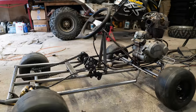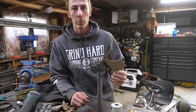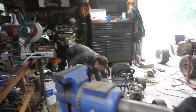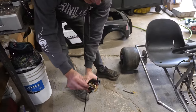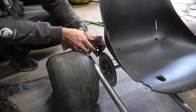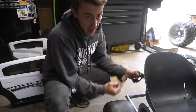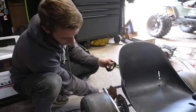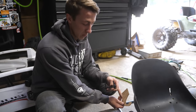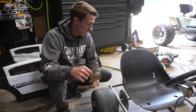I'm doing a little CAD for the brake caliper mount. I ended up taking the pads out of the caliper so I can slide the bracket out. I took the pads out, slid this bracket out, and then used the bracket to mark the rotor in that same shape. That way, once I put this up here, I know roughly where the caliper should be. Now I can cut that out, put the caliper back together, make sure it's going to fit around the rest of the body of the caliper, and then cut this out of metal to make the real mount.